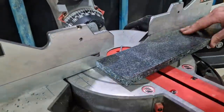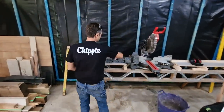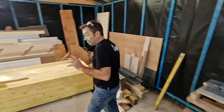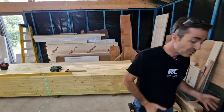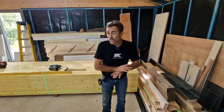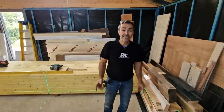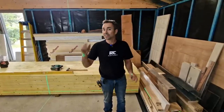Ed has cut all of the plastic shims and we're going to attach those to the bottom — we'll just pin them straight to the bottom of the sole plate. We'll put the sole plate down and then put a concrete screw all the way through to secure it. We're able to run a continuous sole plate all round; we're not breaking at doorways — we don't need to do that, which is a really nice detail. The hardest job is the first lot getting drilled and fixed, and then the next ones after that are easy and we can just whizz round and start building studs.